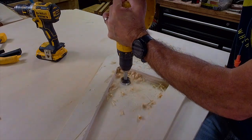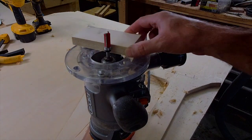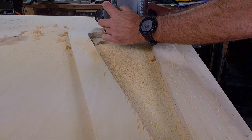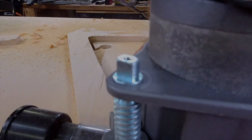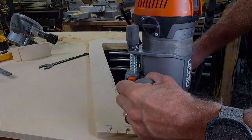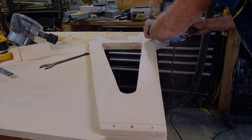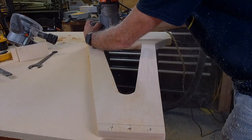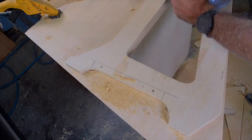So these are the sides we're looking at right now. That's a template for routing and we're going to make two sides just like that. We've got a flush cut bit on the router and we're going to go ahead and route these parts. We're using higher quality plywood — this is the stuff we got at Mims Lumber in Nashville. It's hardwood plywood, I think they call it Baltic Birch.